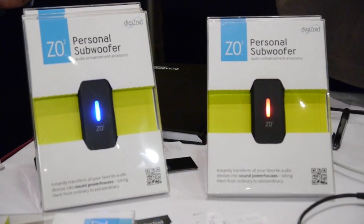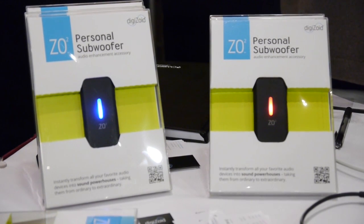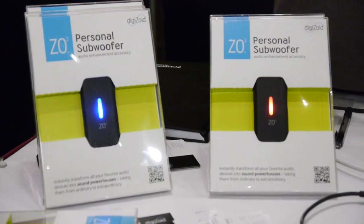The Zotu, that we call a personal subwoofer, actually isn't a subwoofer speaker. It's an electronics device that simulates the sound of a subwoofer, but it's all analog circuit technology — not a digital DSP. Using the right combination of components and energy delivery, we're able to reproduce on small speakers such as those in headphones and in-ear monitors down to 30 hertz with very good distinction and clarity, without interfering with the mid-range and high range like some bass boosts do. We also do some time domain separation of frequencies such that it simulates room acoustics, like you're listening to a stereo system in your home.